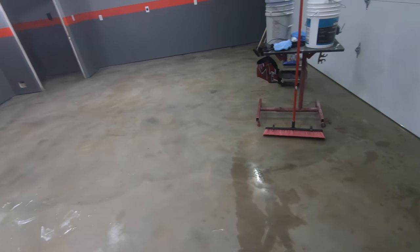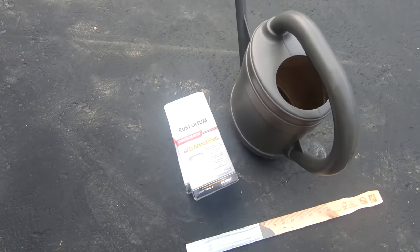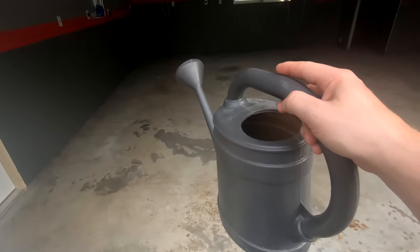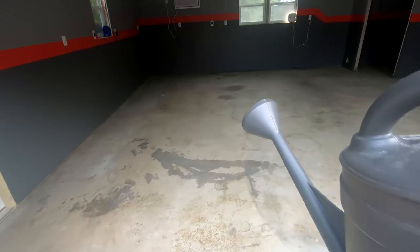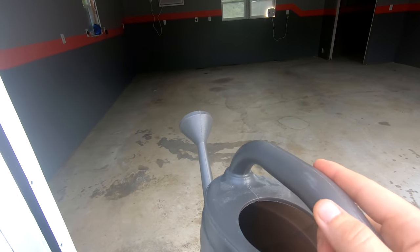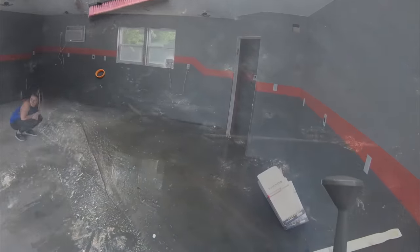For today's cleaning exercise we're going to be using the concrete etch. Essentially it's one of these pouches per a two-gallon jug, using a watering can. We'll do half of the watering can in the back left and another half in the front left quadrant — four quadrants total, so two packs will do the entire thing. We're going to wet it down first like the instructions say, squeegee it off, pour this on, wait two minutes, and then scrub it in. So another day of solution and scrubbing — let's get to work.